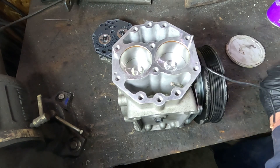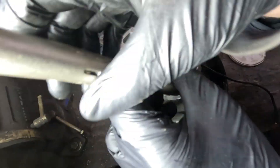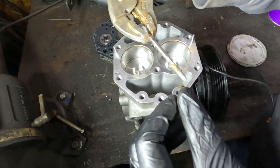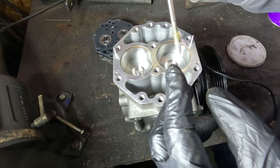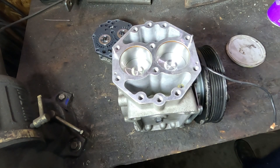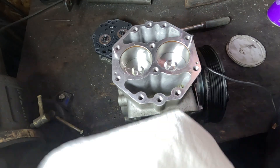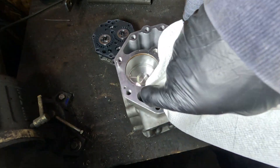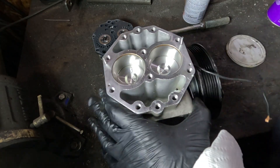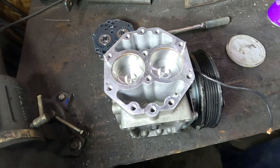What we're going to do is plug that hole. I should have run that tap in far enough — you only have to tap in that far, that's all you've got to do. Now I've got the tap run in. I'm going to pull the tap out. Hopefully you can see — the grease held the chips right there in the tap so the chips didn't fall down inside where they could destroy something. That worked out really well. Now we're going to clean this up with some brake cleaner — my favorite solvent — to clean the grease and make sure there are no metal chips inside. That's looking good.